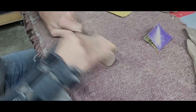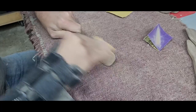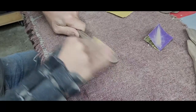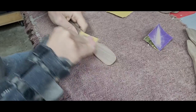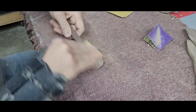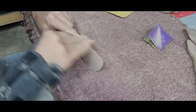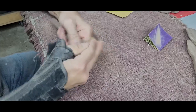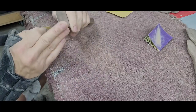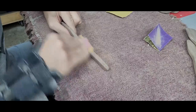I used 120 grit and 180 grit paper to remove any last bits of machine marks, imperfections, or tear-outs. I started by easing the edge of the spatula and blending them into the roundovers. Then I just smoothed out everything else. If the tip of the spatula seemed too fine, I sanded it a bit just to give it a little bit more meat. After wearing out my right hand and my left forearm, I called it a night.